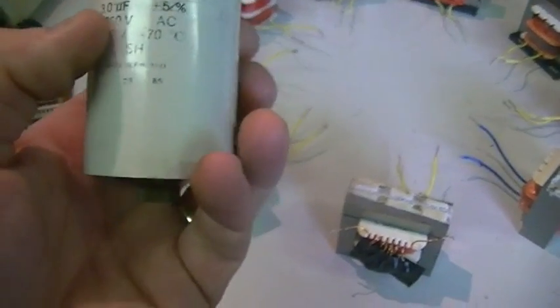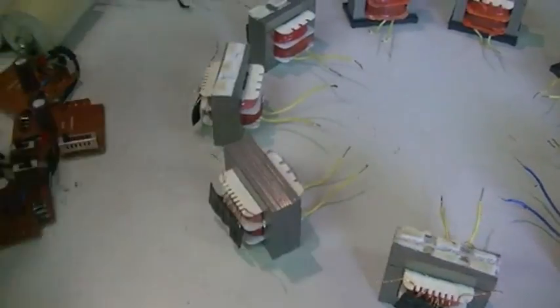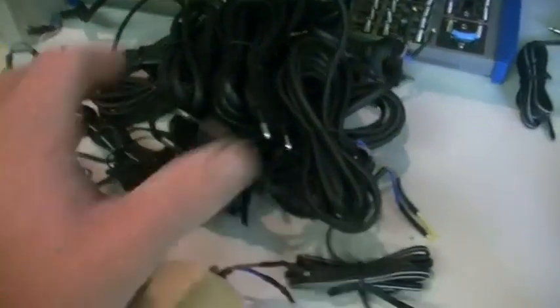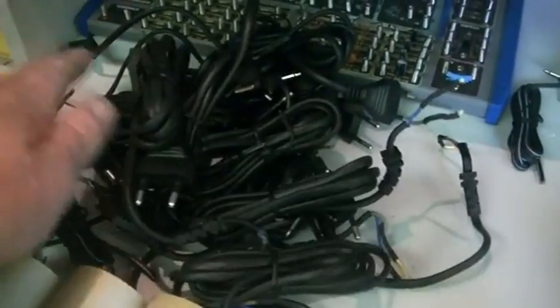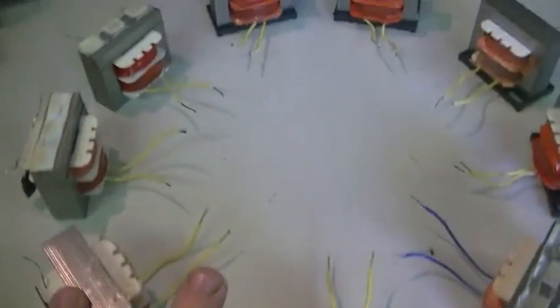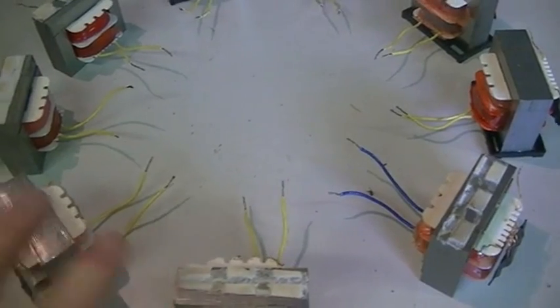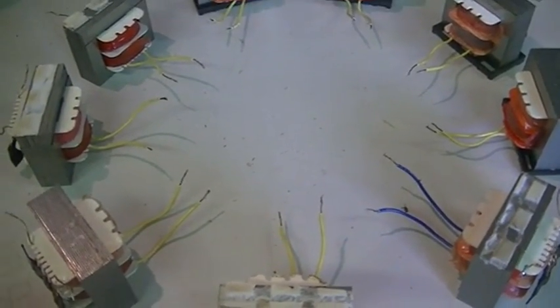The caps we are going to be using are these ones here — 3uF, 600 volts AC. Sounds impressive, fantastic, that's sure to make it work. And we of course have a bunch of wire to go with it. So let's keep building — we're going to mount it all on this pretty little board here and start putting it all together. We are going to need a feed transformer; I'm simply not going to put mains through this and kill myself, so we're going to go around 24 volts.